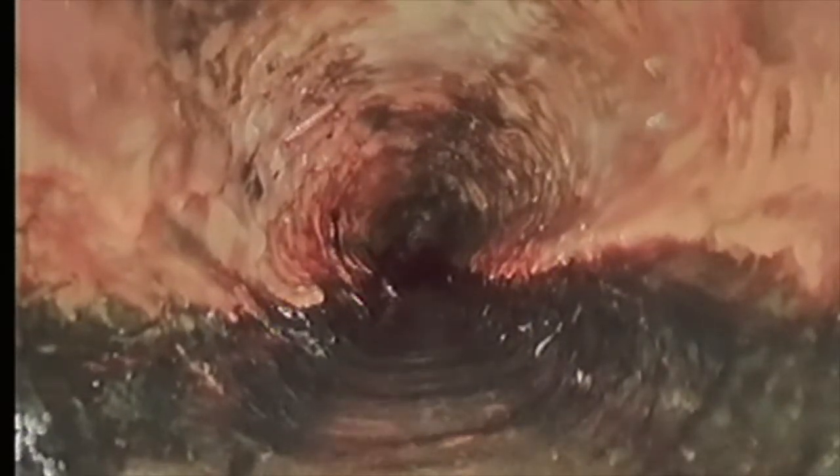Let me see if I can get a better picture. It's just a little excessive grime and grease. This clean-out was next to the kitchen. I tried but there was an improper curve there and I couldn't get to the city connection. I'll note it. I do recommend having this line hydrojetted because it did have some occlusion or some backflow when I put the hose in. I will upload this video to YouTube. Thank you very much.